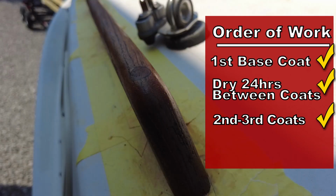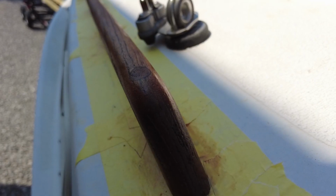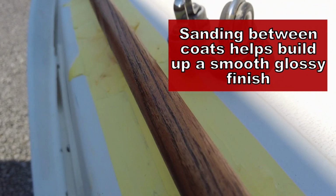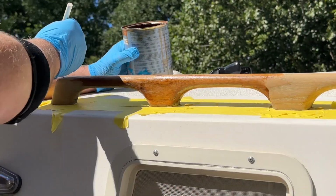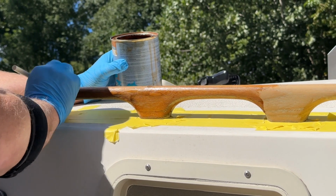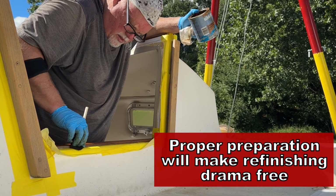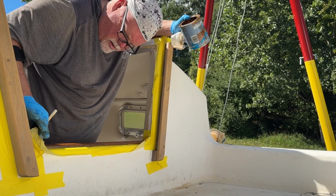At this point, I'll take some time to sand down the teak to get it back to a dull, smooth surface. The whole purpose in doing this is to take down the ridges so that the wood becomes smooth. The whole purpose of the prep and the masking and getting everything ready is so that these initial coats can be applied relatively quickly. You just want to get everything covered and be sure not to miss any spots. Apply extra coats where the wood gets a lot of wear.